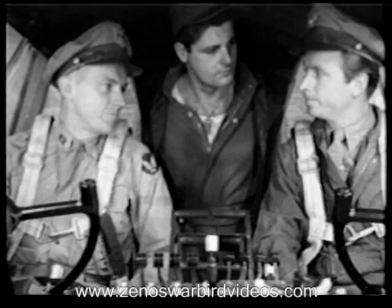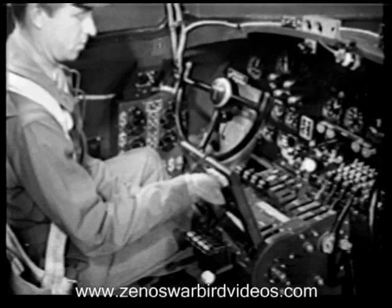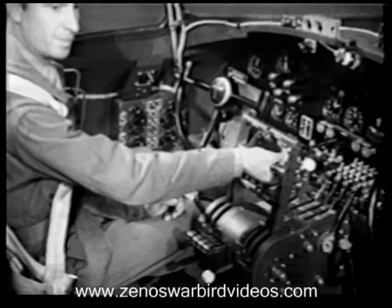Adjust your throttle so they won't creep when the engines get going. Move the throttle lock up slowly and keep testing throttle movement until there's enough friction to hold the throttles firm, but you can still move them with a fair amount of ease. You got it? Yeah. Close your throttles right down against the bottom.